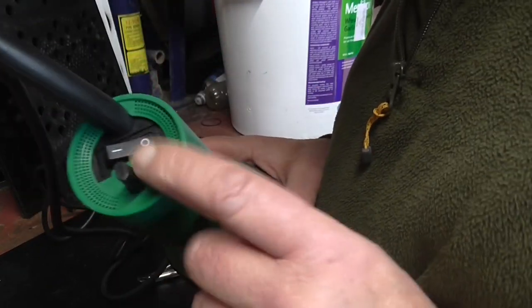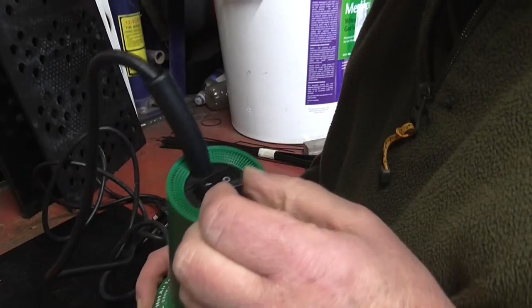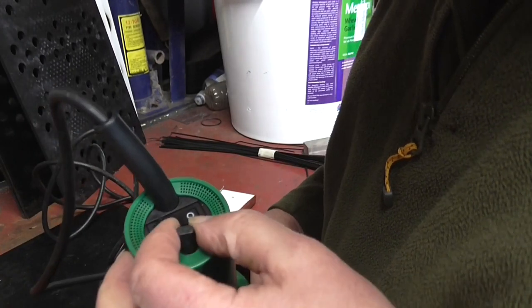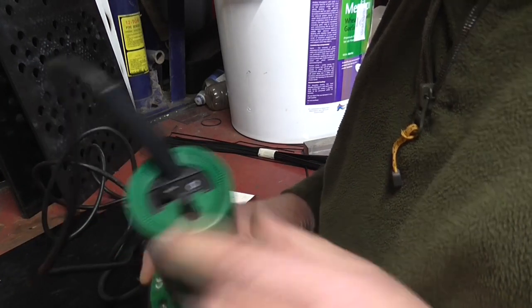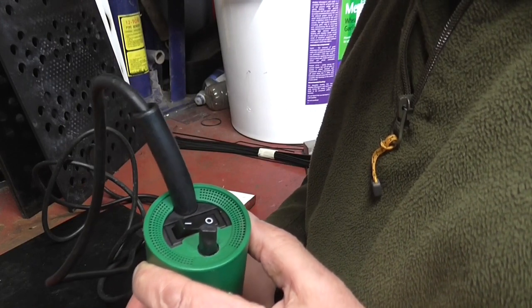Now I've found with the PP here that it wants to be about a quarter of the way round on the clock face, well, a bit more than a quarter, 9 or 10 o'clock, for these little rods that I'm using. Even with new glasses, I can't actually read what's bloody written on there.